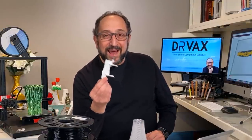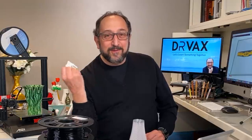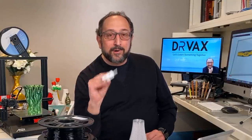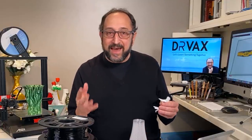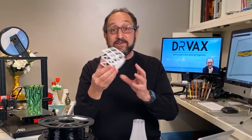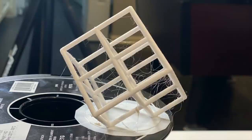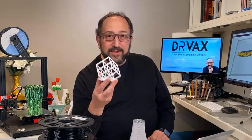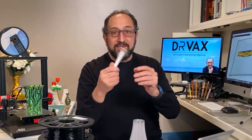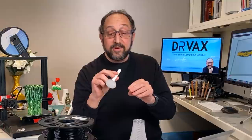This is a very interesting print — an electrician had cut all the power to my house in the middle of this print on the Anet ET4. Power came back on, I went to the front of the printer, said restart, and it restarted perfectly. I know people have mixed opinions about the Anet ET4 because of its proprietary firmware, but I've become a fan — it's a pretty solid printer. I then printed a longer item that took about four hours. It printed very well with no drooping, but it's a little messy due to stringing. I'll either drop the temperature or fine-tune retraction. I also created a long narrow tower in Tinkercad to test layer adhesion, and it printed beautifully.